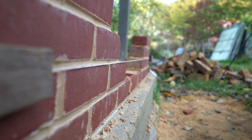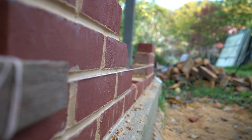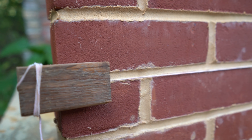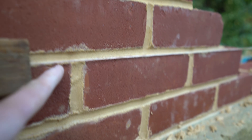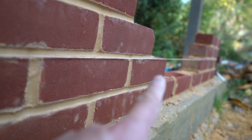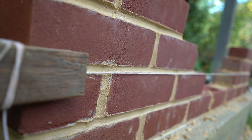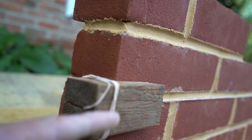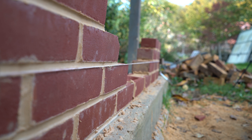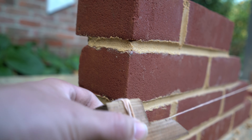Look down the line at a low angle — because this is a short run it isn't sagging all that much, but this is the best way to check. You want to look down that line and in the middle section, if it sags too low then it's miles too loose. The idea is you want to put your corner block on the end so that the line is touching the top of the course you want to lay. If it's too tight, you'll know because it will snap, or you won't be able to put the corner block on the end.